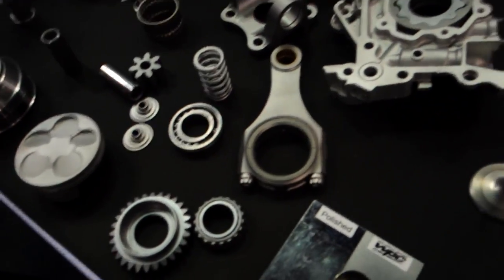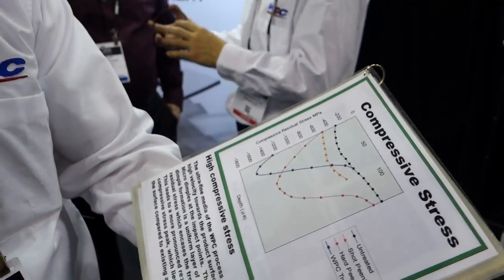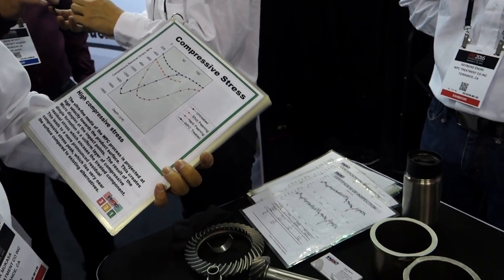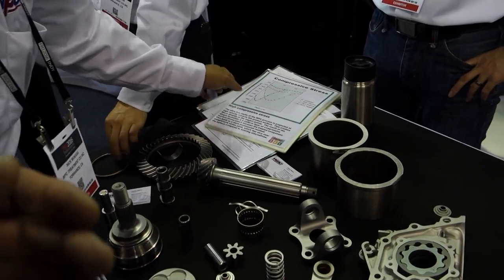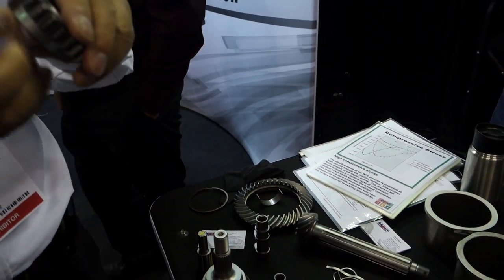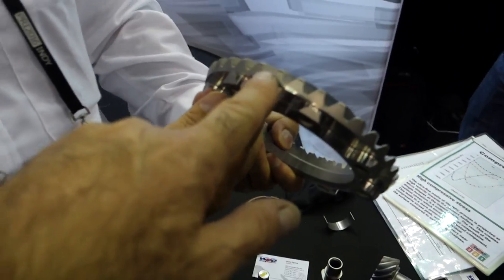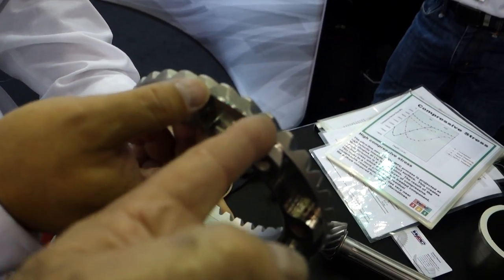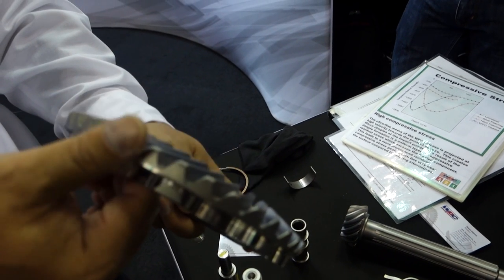And they come out with a beautiful finish too. They look nice too. It can take more compressive stress. Exactly. It prevents the heat cracking or bending cracking. Well, in gears, mainly for me, it's gears. I do gears, so it could be stress cracking on the roots. Chipping. And typically the gears will break along the roots down here, they'll start to crack right over here. It's like when a pinion will start to peel away over here, right on this edge. Unbelievable, very nice.